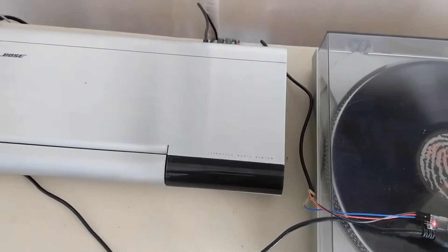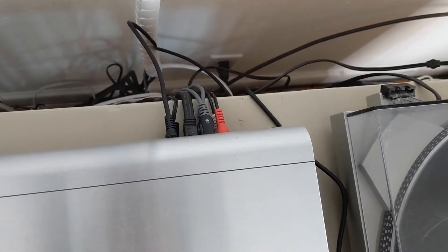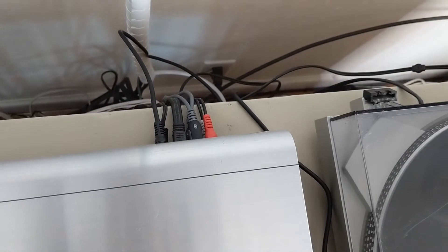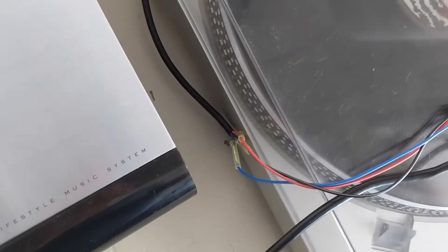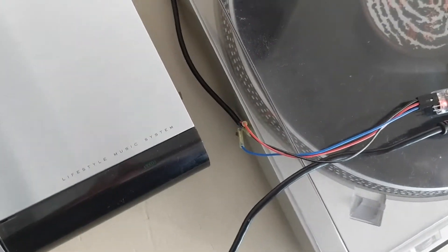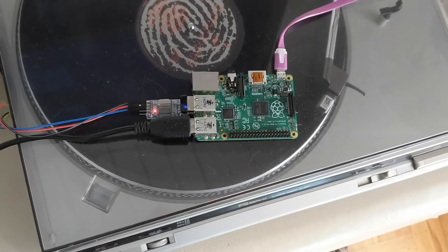The first thing you notice about the 25 is that on the back of it, it's got this little plug-out that was for servicing and a serial port. It turns out that this is actually an RS-422 port. What I've done is gone ahead, taken a 3.5mm audio cable, hacked that up into its constituent components, and hooked that up into a Raspberry Pi.